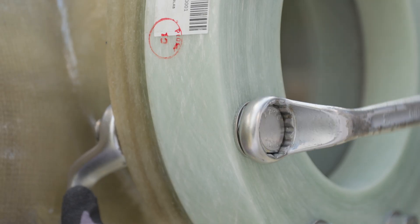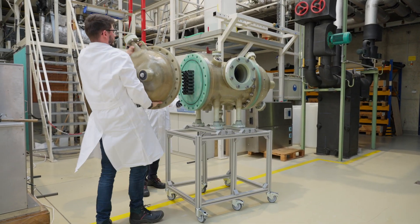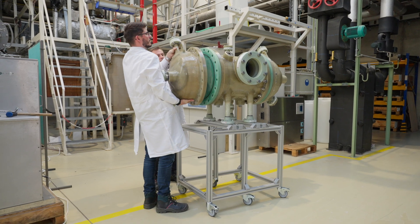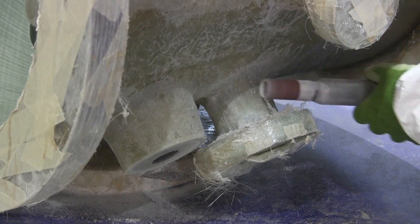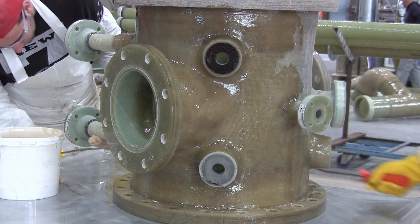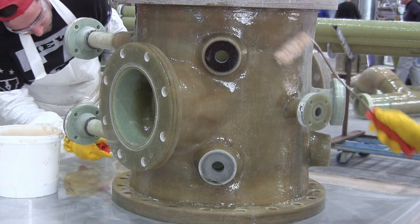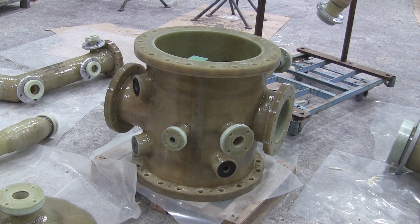The tube plates and other parts, such as the shell and flanges, are constructed using fibre-reinforced resins by TPR FiberDur GmbH and Co. KG. Polymers have a very high corrosion resistance and they have a low weight and they are less susceptible to fouling. Highly corrosion resistant materials must be used because of the high chloride content in the brine and because of the high temperatures in the evaporator. A good heat transfer performance of the tube is very important.